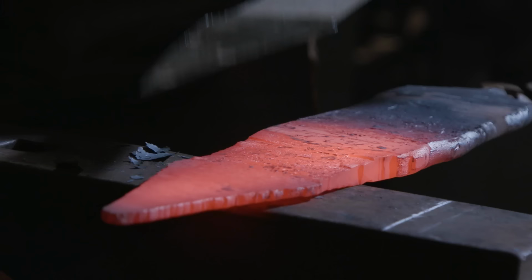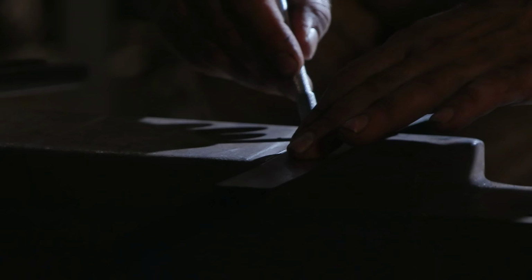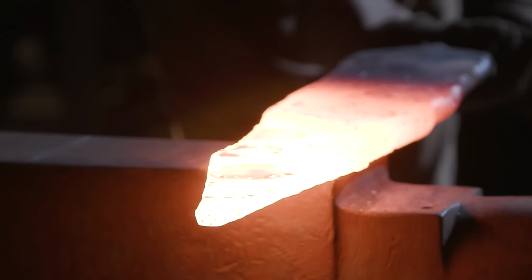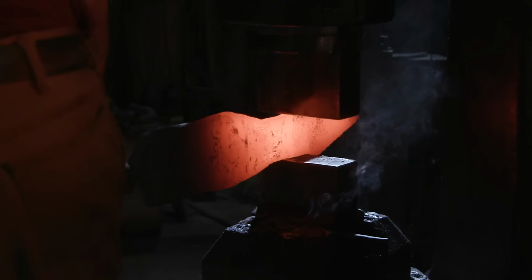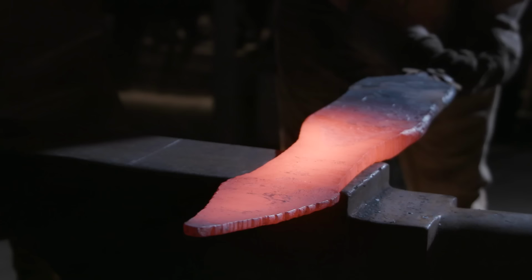Often see the smith, usually with a piece of soapstone or some other way to mark on an anvil or mark on the floor, he'll draw out some specific points that he's trying to reach when he's forming, or a set of measurements so that he can lay out the material as he's forging without worrying about burning up a ruler or anything like that. It's pretty traditional to use the soapstone, and it'll continue to be something you can see even when it's hot.